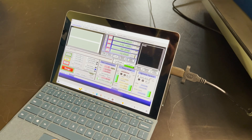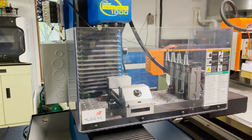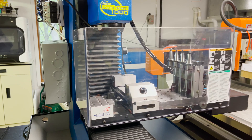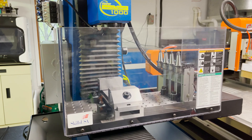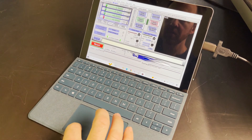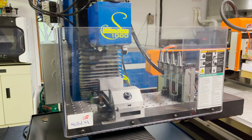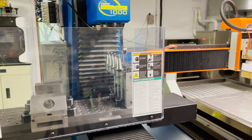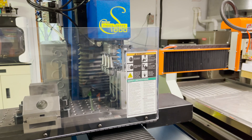Here's what happens whenever the machine gets a tool change command. First, I'm going to home the machine, then move it over to where it would actually be cutting a job. Then I'll issue the first M6 command to pick up tool 1. I think I could make the overall tool change process move a little faster, but first I wanted to make sure it was doing it reliably. So far there have been no issues. I'm having it do an air blast as it lowers down onto the tool, in case there are any chips on it.